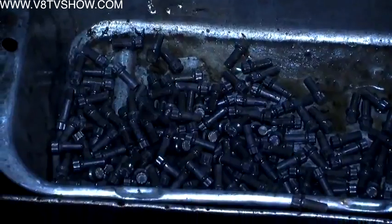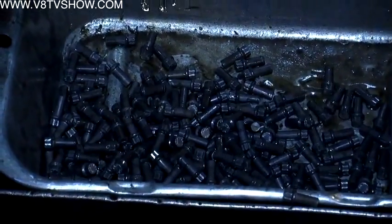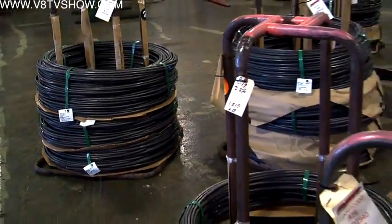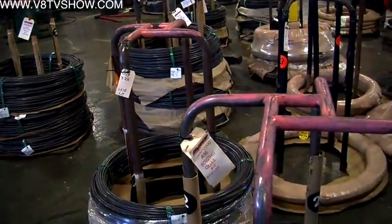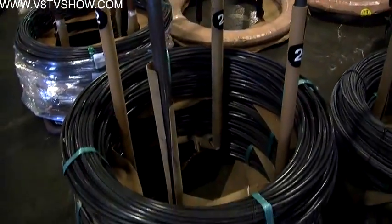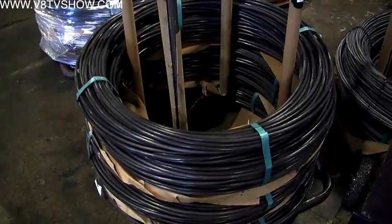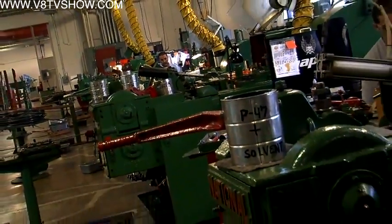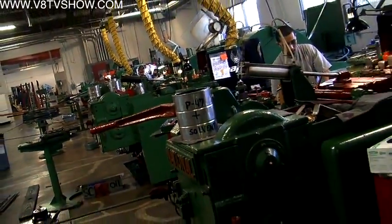You take the raw coil and it starts to form the fastener or stub. I noticed the coils are different colors, sizes, textures. Is each machine doing a different shape and size of bolt or length? The main thing that's different about the machines is the size — there's quarter-inch, five-sixteenths, three-eighths, half, seven-sixteenths, five-eighths cold formers here, cold headers. We use different wire sizes for different bolts.